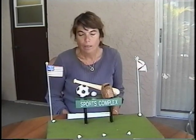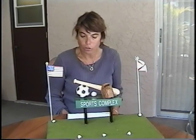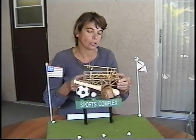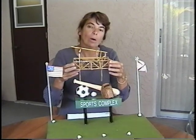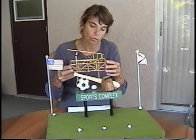The typical process involved with creating large sculpture is the development of a scale model. At this point, you've met with a client, you've discussed their ideas, and you've illustrated your proposal. The scale model is important because it gives you visual reference from all angles. During fabrication, you'll use the model to determine lengths, angles, and the relationship of the different elements. Sometimes if I have a complicated steel design, I'll even create a scale model based on the engineered drawings. I'd rather problem solve on a scale model than out in the field when I'm working on the actual sculpture.